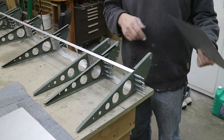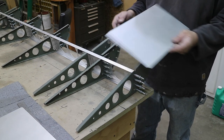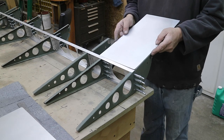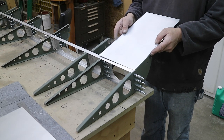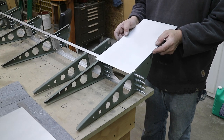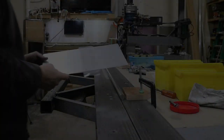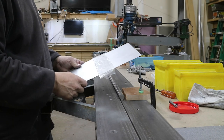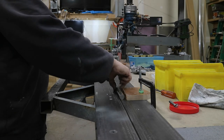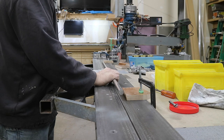I'm working on the nose skins. I blanked out the two smaller ones for the ends. I measured across at the spar what the width was top and bottom - they were about the same - and then cut my sheet. I try to make the sheet a little bit short so we can use a little bit of this radius when we cover it and not have a sharp edge. I'll put my bend line on here and now I'll set up and bend these. The sheets have all been prepared for primer - mark the bend mark, covered with contact paper so I don't mar it up.